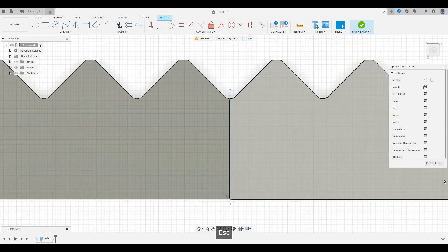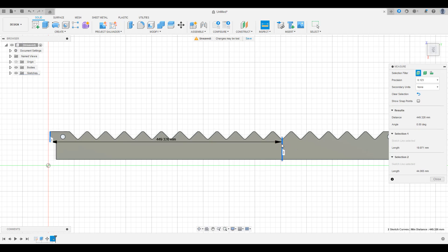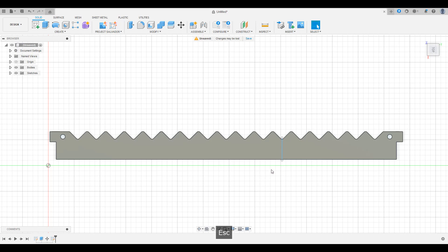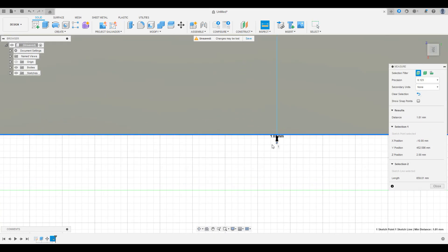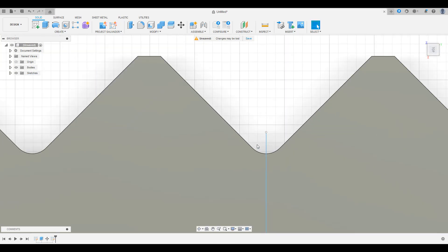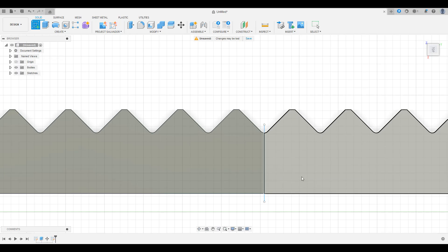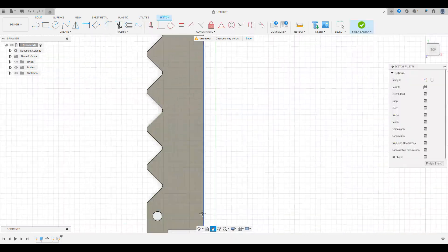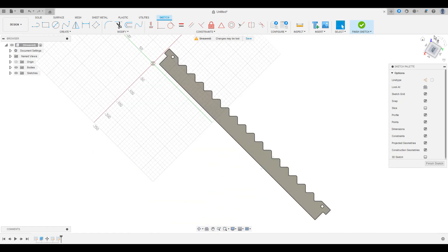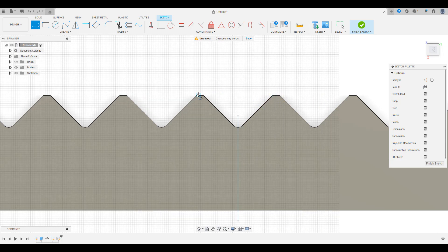On a side note, you can make the short side of the part the first side if you don't want to have to slide the material as far between the cuts. We also want a line at the edge of the part so that we have a node available that will match the location of our index line, in order to create a similar stock point for both sections of the part, allowing for the same start location for both sections.